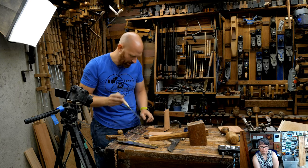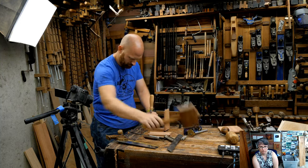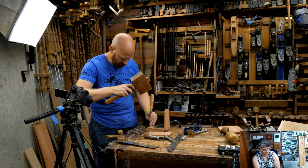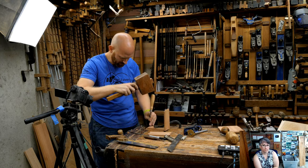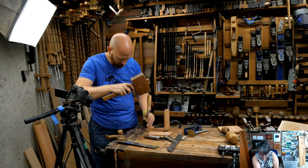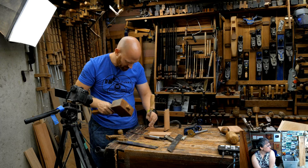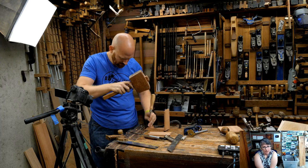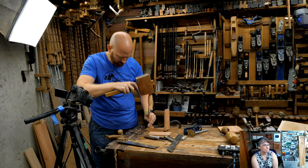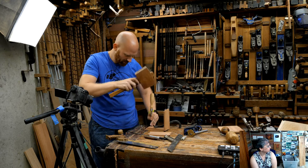But when I sharpen, I don't take off much material. I keep it pretty close. And so because of that, I have less material coming off, which means you have less set that you lose when you sharpen it. Whereas if you end up doing a lot of sharpening, you end up taking off a lot more set. And so which case would be better to set more often?